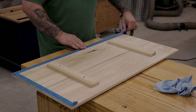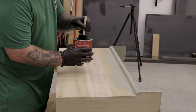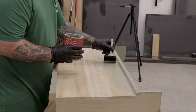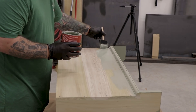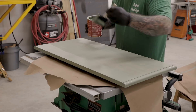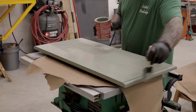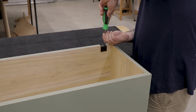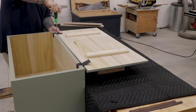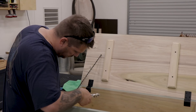Now I'm ready to apply some finish. I'll start by removing the lid and applying painter's tape to the underside of the top and to the inside of the case. I'm using General Finishes Milk Paint in the color basil, applying three coats and waiting about three hours between each coat. This milk paint is awesome to use — I don't think it's a real milk paint but it's made to look like it and it looks great and is really easy to apply. I wasn't sold on the color at first but by the second and third coat I really liked how it turned out — the green looks pretty good. After letting the paint dry overnight, I reinstalled the hinges, put the lid on, and installed eye hooks and a black chain to act as a lid stay and keep the lid from opening too far.